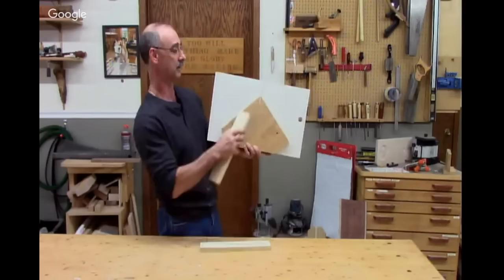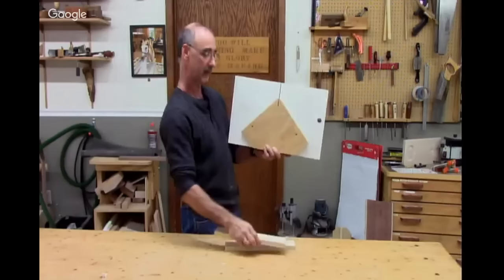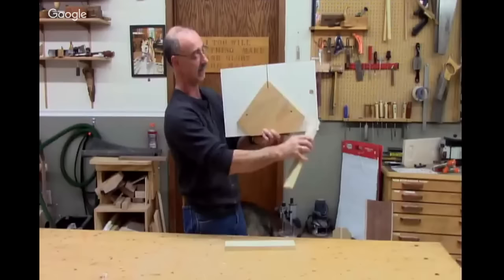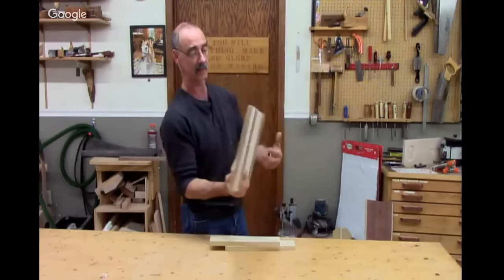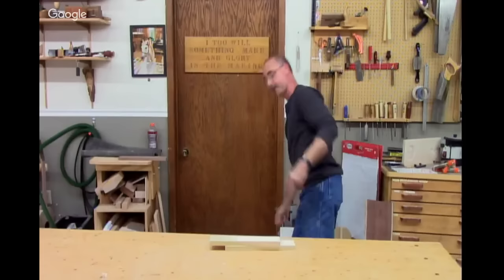The only thing you have to do is make sure you get the lengths of your parts right. It could use a little more refinement — a fence on here that's long enough that you could put your parts on and have them on a stop block, so you're butting against the stop block to guarantee all parts are uniform in length. It's a real easy-to-make table saw sled and goes a long way toward helping with miters. Both angle and length have to be perfect.